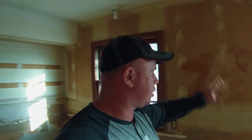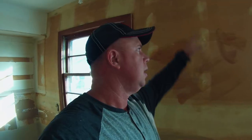As you guys can tell, it works really, really well — I was very happy with the way this worked. Got everything done here in the kitchen; that's all the wallpaper I had to take off. Nobody really likes doing wallpaper, but this thing really makes it a lot easier. Compared to the old way — scoring and using Diff, spraying it on, letting it soak, then using the putty knife — the steamer is much less messy. If you've got wallpaper to take off, I really recommend using a steamer. I'm not sure how much they are; I actually borrowed this one, but I think some places like Home Depot rent them.